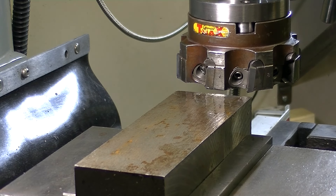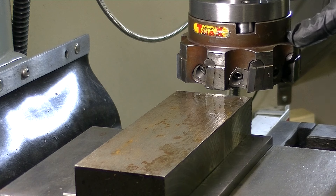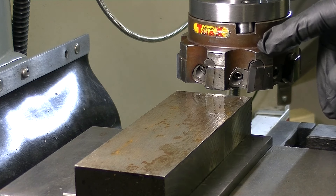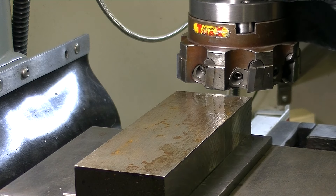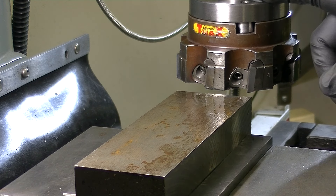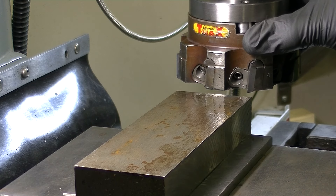I'm going to do something really dumb here. I've just put this huge milling cutter on this small Bridgeport. This thing takes eight cutters and it's about six inches in diameter — way too big. It's an R8 arbor, so it's really not meant for something like this. This is a custom arbor that a machinist had made, but this machine is only one and a half horsepower.